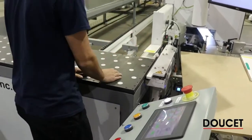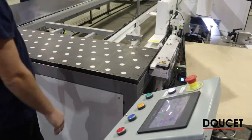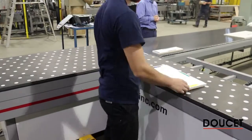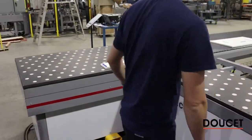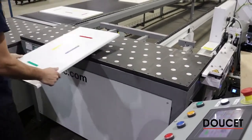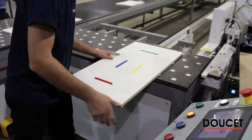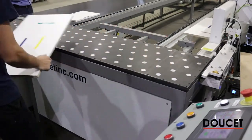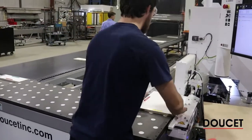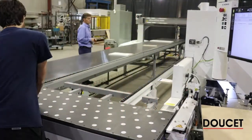Now we're running in random mode, which means every time the operator feeds a part he's indicating to the system where to go based on the pass he's doing. This could also mean that if we were interacting with an ERP signal or barcode, the ERP system could relay the information to the RETIX knowing what to do. At all times we need that signal when coming into the bander, because the RETIX manages the queue of parts in transit into the edge bander. As you can see on the return, we don't always have the same indicator at the same position — it depends on where the operator indicated he was in the queuing sequence.